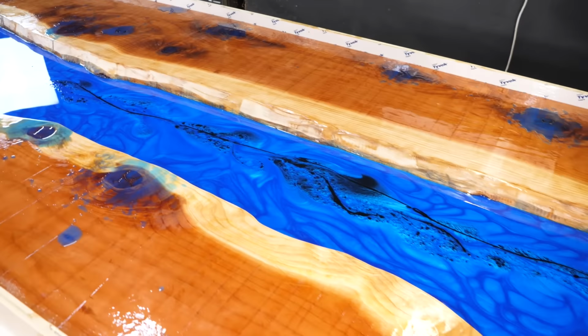Grab an angle grinder, grab a metal fiber sanding disc, 80 grit, and remove the drips. Follow that up with 220 to smooth out any rough scratches. I left a link in the description to a landing page all about the Ultimate Top Coat.